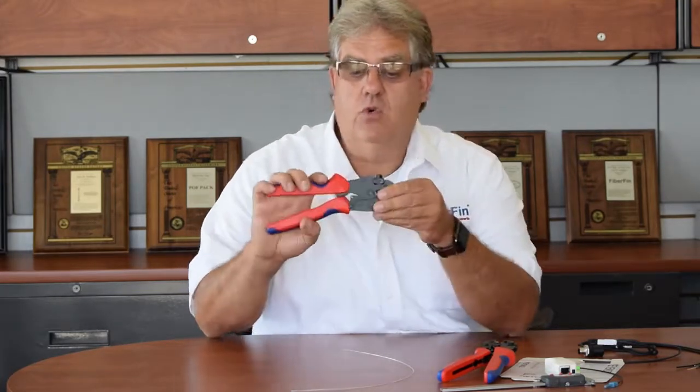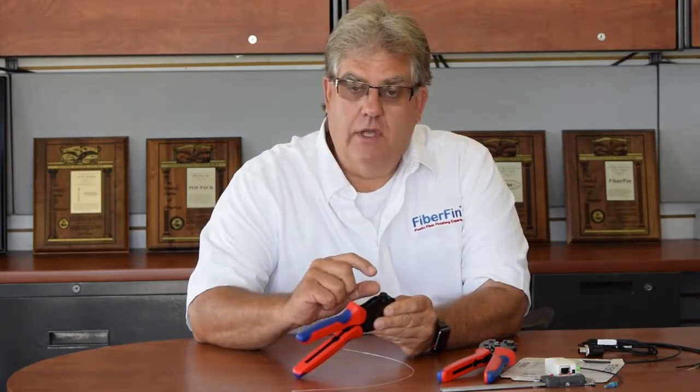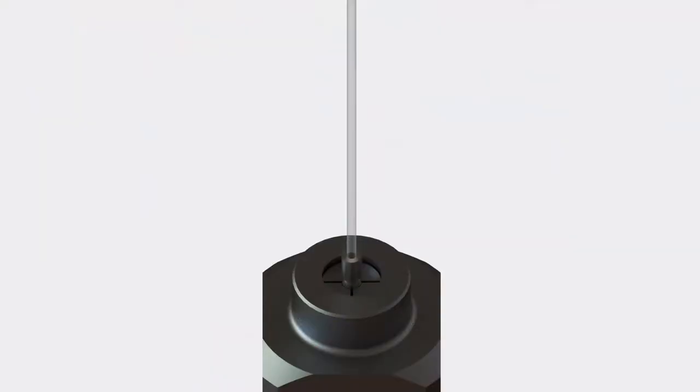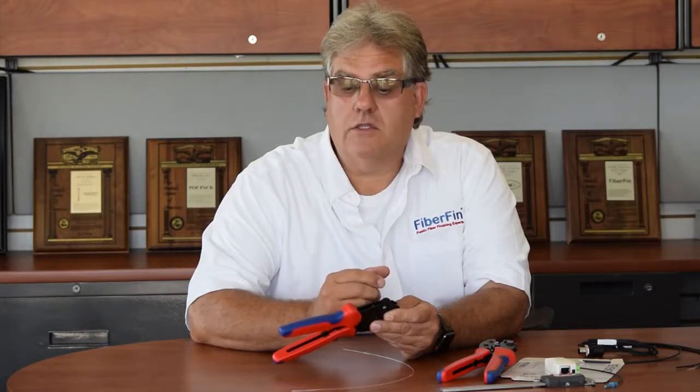There's different kinds of connectors in that, but what it's doing in that swage process is, in this tool right here, it uses this collet and it forces the collet around the metal ferrule, and it's deforming it or swaging it around uniformly. And what it does is it actually aligns and makes the fiber and the OD of the connector concentric, and that's very important when you start talking about actual loss in the connector itself.